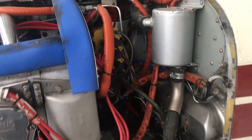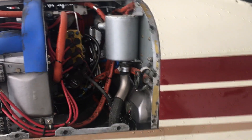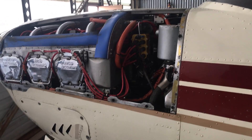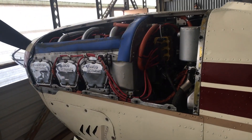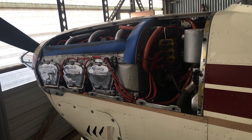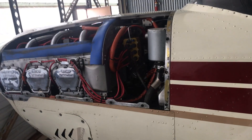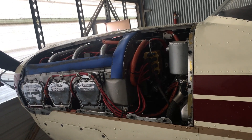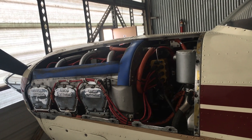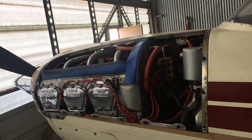I think that summarizes it and I look forward to comments in the comment section. I can do nothing but recommend E-Mag. If you're using traditional magnetos, you're behind the times. It's a safer arrangement, your engine starts better, and if you were to have a problem I have a lot more confidence that I will get that engine restarted. It's a stronger spark, more efficient — just everything about it makes more sense, and the simplicity of how to time it is impressive. Shout out to the E-Mag crew for advancing what we all care about.